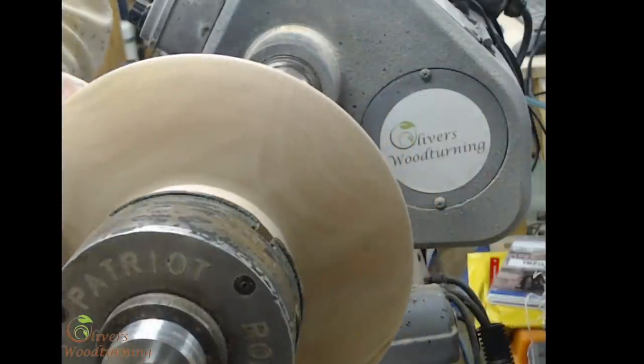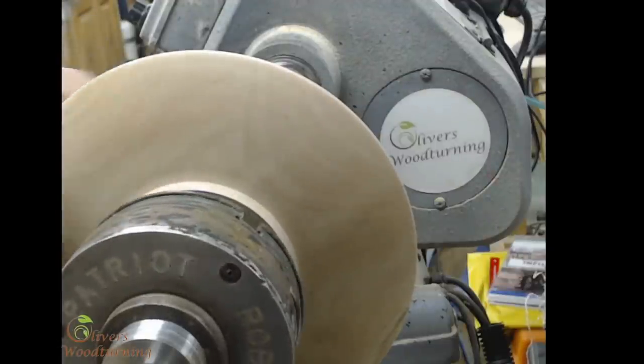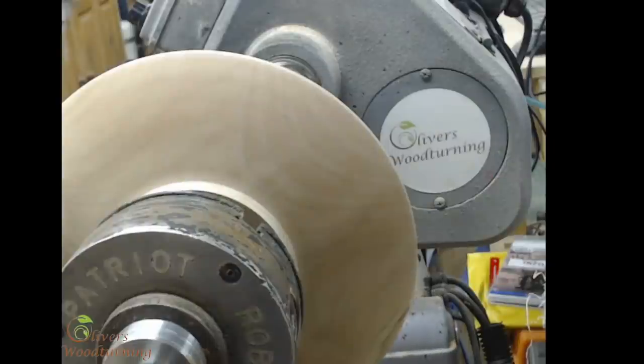Right, okay, now that you've stopped waffling. Yes. How much PSI does a compressor need to generate the suction and to use it to work? How much PSI? Right. I've run it on the Bambi, which is 2 CFM. What CFM is to everything else, I don't really know. It holds it on, but not as tight as the bigger compressor. So I would think you really want a minimum of 3 CFM of output on a compressor. Most compressors put out 4 or 5, so the Bambis are more about the silence.